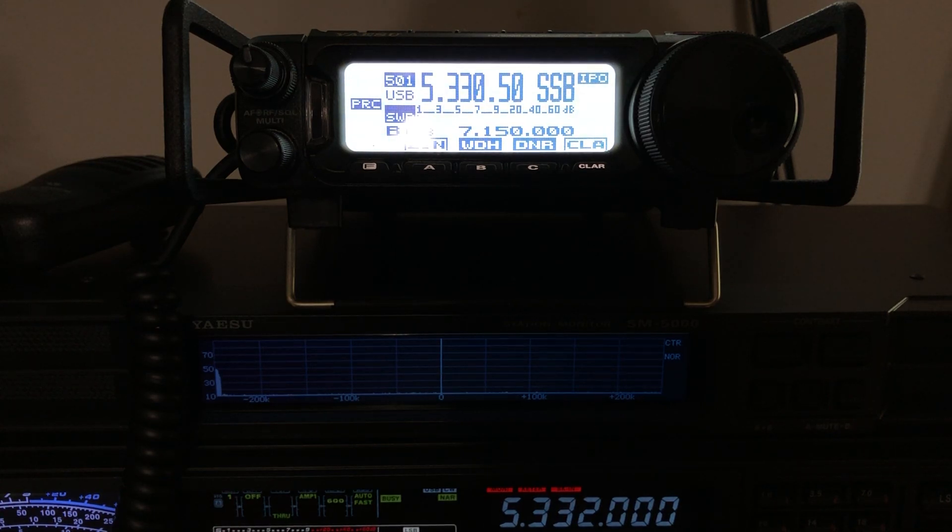Why did I do that? When I was up on a mountain the first time using this radio, I posted a spot on SOTA telling everybody I was on 5.332 — because that's what my display said. A guy came in and chewed me out, saying 'You're not on frequency, you said you were on 5332, you're on 5330.5.' When you're up on a mountain typing this into a phone or APRS, you just type what you see. So I decided to do this with mine so I'd be sure to send out my spot with the correct frequency, because not everybody understands how 60 meters works and because it is different than the rest of the bands. That's why I shot this video.